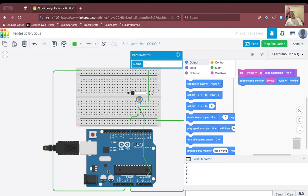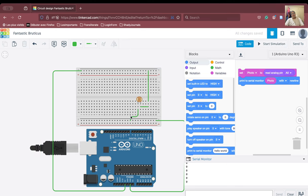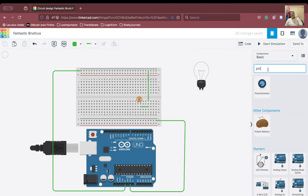What has happened here? Let me see very clearly. One of the terminals is connected to the power line. But if I connect like this, it means that the A0 line and the ground are at the same potential, which means there will be no signal. So, if I want a signal, I have to do something a bit different.